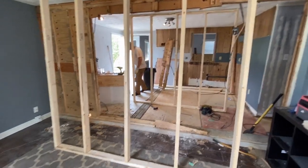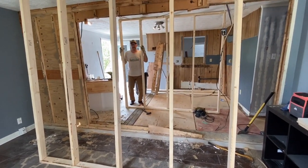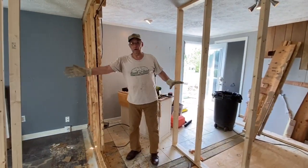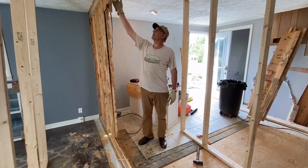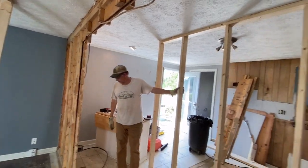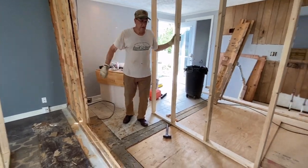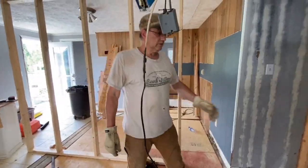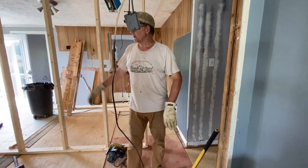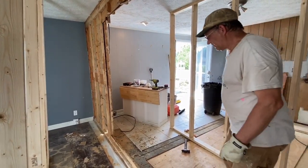Now the hallway floor and the floors are in. There's a new wall together here, but this is just a temporary brace. There's not going to be any walls here — he has to cut this out and put a header in there, then he can take these down. He's going to build this out about a foot so there's room to put switches, and then that'll stay right about there.